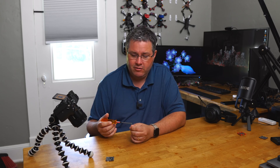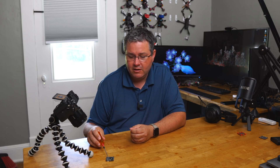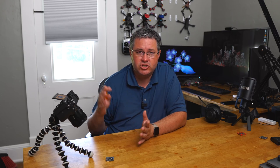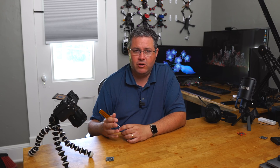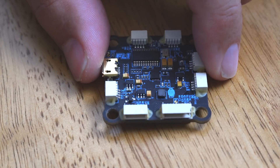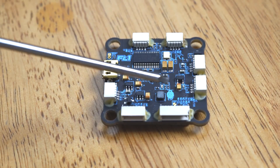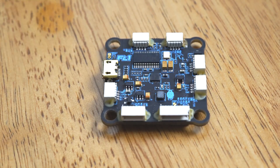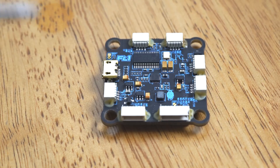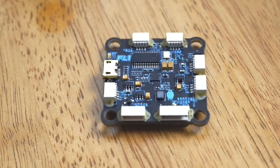If the diode is bad you can replace it. But if the voltage regulator is dead — which is usually visible damage because it's usually a short that draws so much power it burns a hole in it — there's a simple solution to get the board back online. There's a pad labeled five volts. Basically what you need to do is solder bridge that pad, then feed 5 volts in on one of the 5 volt pads or through your ESC connector, and the board will now be powered off of 5 volts.